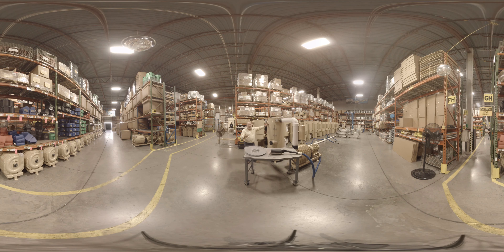I want to talk about our stainless steel doors. Recently we've had some concerns about paint quality. We use a marine yachting paint — it's designed for harsh environments, salt weather, outdoors — so we don't get a lot of fading. But if we don't handle the tank properly, we have had some rusting. One of our problems was on the outside of this cap — we made a cap that was a spun dome to keep the water off. We used to weld the inside; now we weld the outside so we seal in any moisture and it can't rust and run down. We also changed our two doors to stainless steel, so now we have stainless steel doors with stainless steel hinges and won't have any more rust running out.